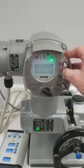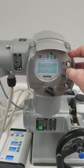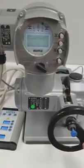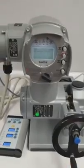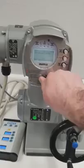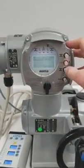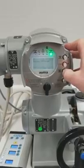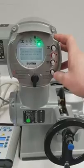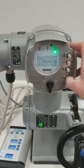When you're doing this, just pay close attention to the valve as you approach the open limit. Stop it and finish the rest of the way by hand. The actuator has no way of knowing where to stop because you're setting the limit. But once you have it positioned, same routine — you go back to the settings mode. It's still on the screen where it wants you to confirm. Go ahead and hit enter and there it's set. To back out, just hit the programming button and keep backing out until you're back to your main screen.